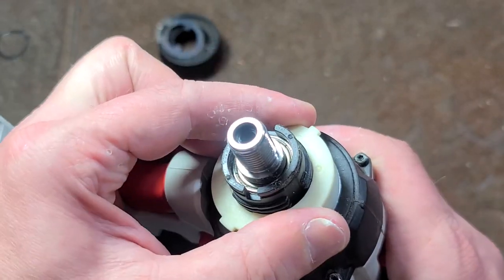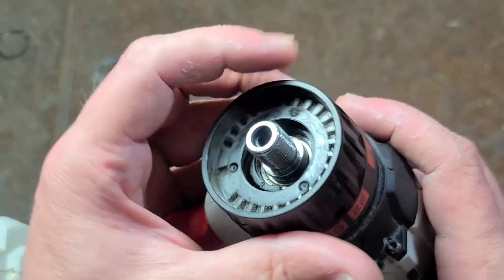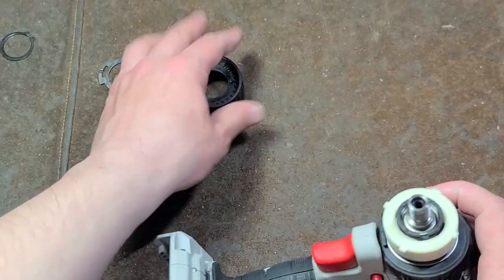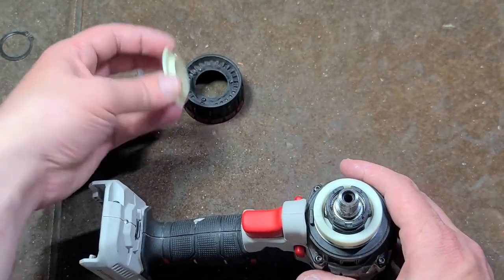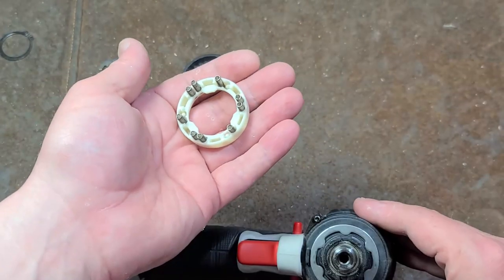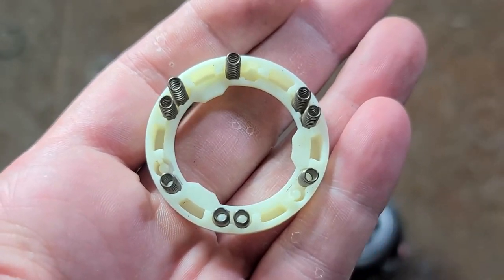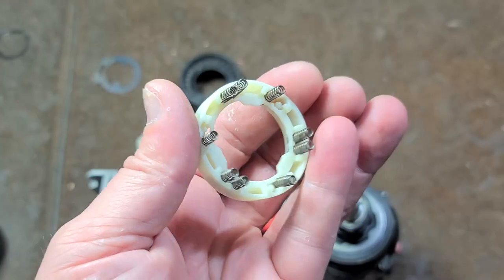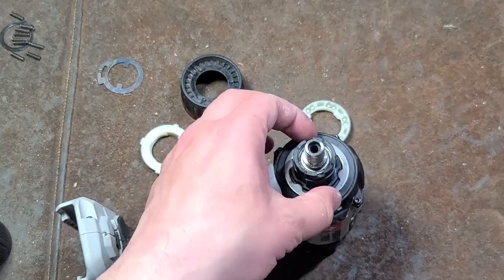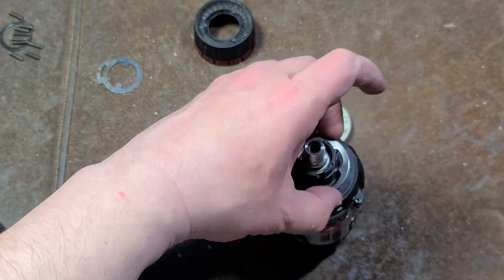This collar is doing a screw which is pressing on some ball bearings, which ride against a ridged plate inside the gearbox to provide a traditional clutch — the kind that goes over and vibrates. Strangely enough, this is designed to have 12 springs, but they only put in nine. Not really sure why, but I'll keep those springs for spare parts. They probably engineered 12 springs and then in testing realized that with just nine springs they could prevent the clutch from slipping even in drill mode. I've often seen that.